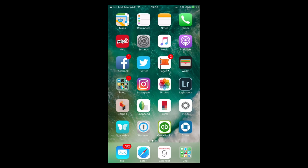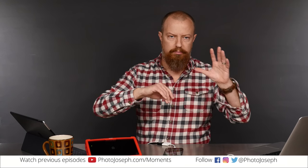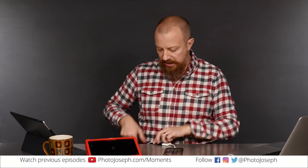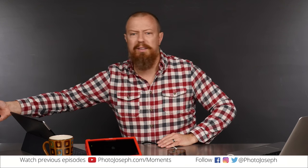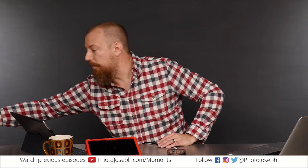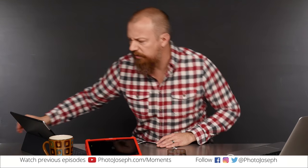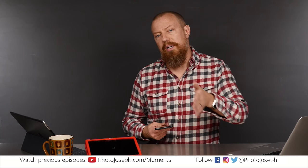The next obvious question is: where does that video go? In my case for these broadcasts, I have a big switcher — and one of these days I'm going to do a full tour of the broadcast studio. This HDMI signal goes into a switcher. In my case it's not going directly into the switcher because I have to change frame rates, so it goes into something called a decimator — a cool red box. These things are phenomenal; they allow you to convert anything to anything HD. They don't do 4K yet. I'm converting my 1920x1080 at 59.94fps into 1920x1080 at 24fps, which is what I need for this broadcast.